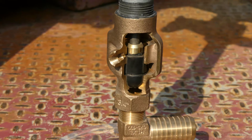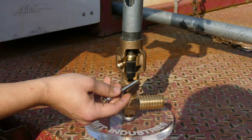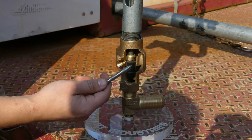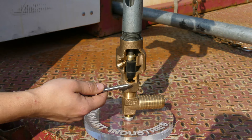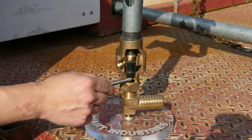We'll start down here at the bottom. The first thing we're going to focus on is this plug here. You notice that your water comes up through this area and then this plug is going to hold the water back. Generally with these, the frost-free hydrant — this section of it — is below your frost line. Depending on where you are in the world, you're going to have a different frost depth. Here in North Idaho, generally ours is four feet, three feet if you want to be risky.